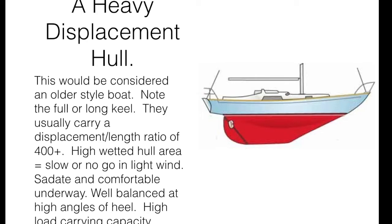There's a lot of hull here. Most of these boats do not have bolt-on keels — the keels are integral to the hull, part of the actual hull molding. The ballast for these boats is inside or encapsulated into the actual hull. The advantage there is there are no keel bolts — you don't have to worry about bolting through the hull to hold your keel on. So there's no maintenance or worry about keel bolts rusting or backing off and your keel falling off. That's a definite advantage.